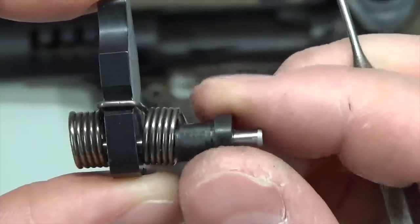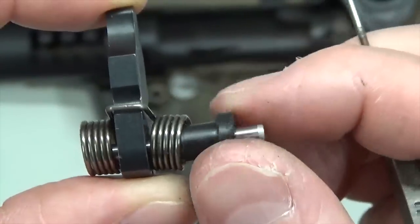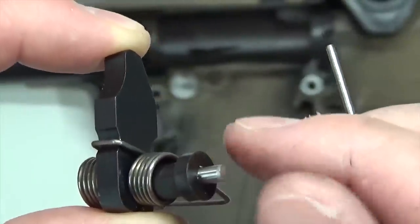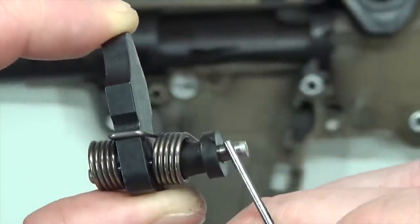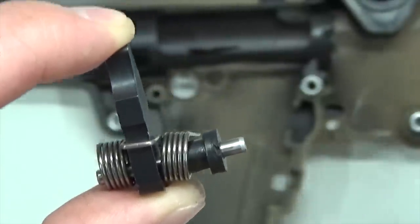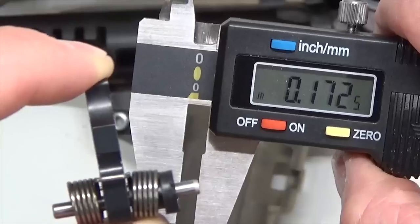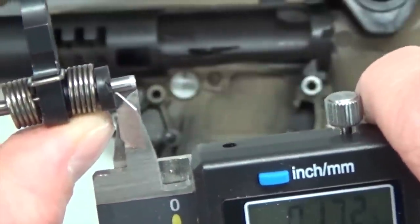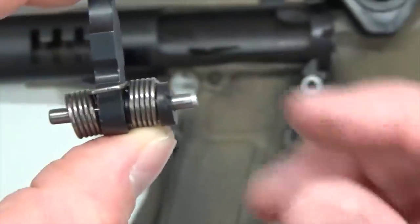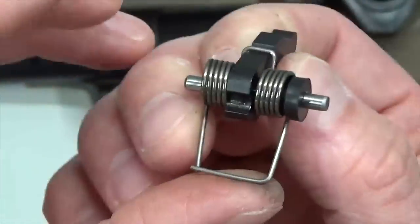You can see the strike face of the hammer, your hammer spring, and the hammer hinge pin with the plastic bushing. The loop of the hammer spring is behind the strike face, and the broken end faces down — that's what goes down into the assembly during reinstallation. One important note about this hinge pin and bushing: if you order them from Kel-Tec as replacement parts, they come as separate pieces. We went through a big troubleshooting process and eventually figured out the hinge pin and bushing were not at spec. The measurement is 172 thousandths of an inch — that's how much of the pin should be sticking up out of the bushing. Good number to know for troubleshooting. Leave this assembly together and set it aside.